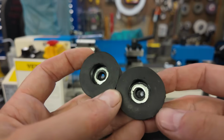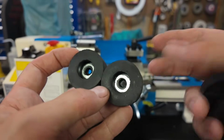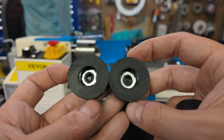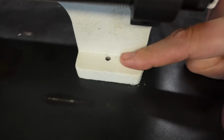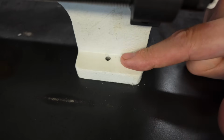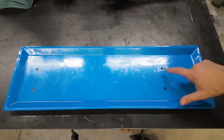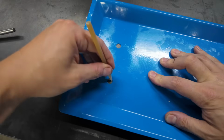it's a small machine, so probably the heavier the workbench you can find, the better. It's just going to benefit from being bolted down securely. On the upshot, there are already 4 threaded holes in the feet for mounting those little rubber pads that we can take advantage of for bolting down the machine. And the chip pan has the matching hole pattern that we can use to lay everything out on the bench.